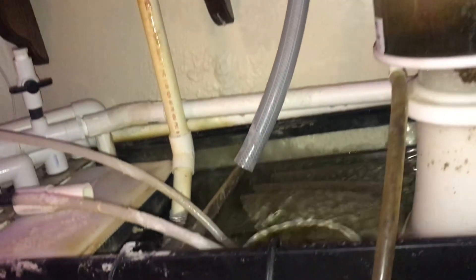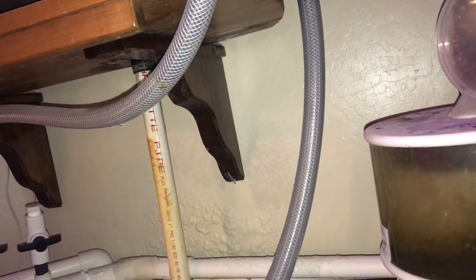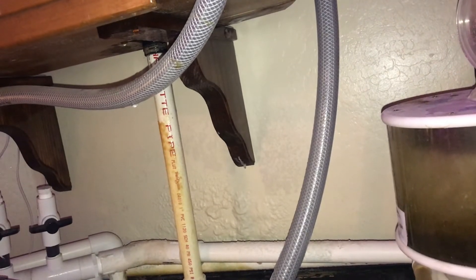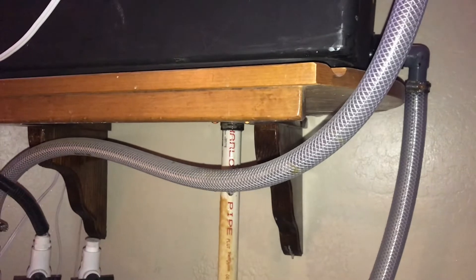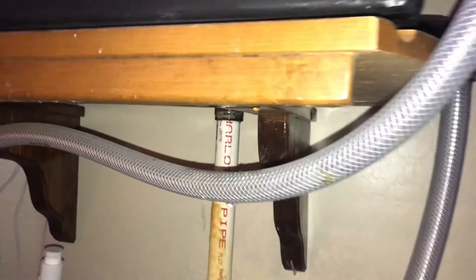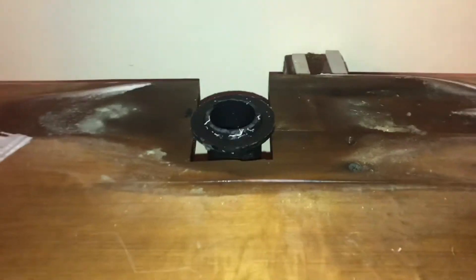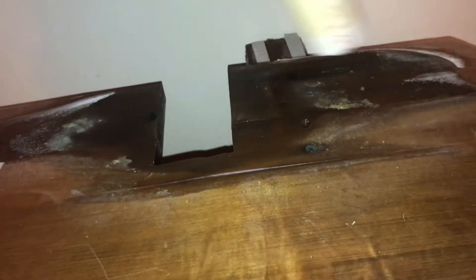Here is the leak from the bulkhead. That brown on the PVC is from a small leak I'd been trying to fight for some time. About a month and a half ago I tried tightening the bulkhead a bit tighter to solve it — it seemed to stop, then all of a sudden I woke up to this massive leak. Over-tightening the bulkhead is what caused this, though I'm not sure whether that was also the original cause or whether the tote was too flimsy for the bulkhead to start with. Regardless, we're making the new one out of an aquarium so I won't have that issue.